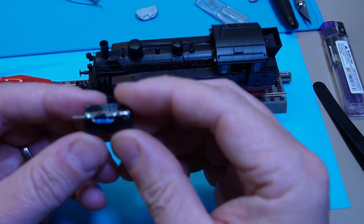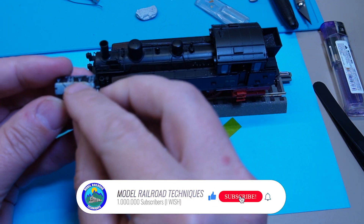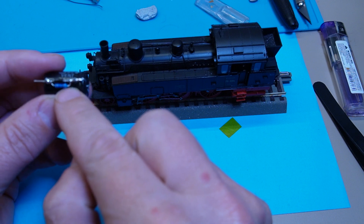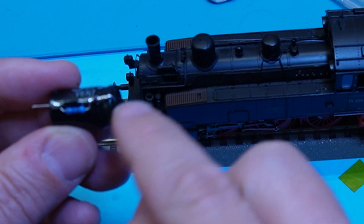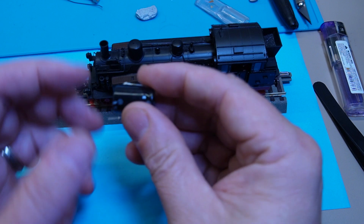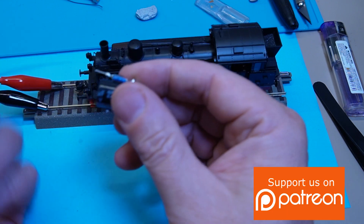So we'll start with the little assembled circuit here. We've got the cathode side, which is the negative, and all the other components go on the anode side. You can see the non-banded end connects to the anode of the capacitor, and then the cathode end goes out to the positive of the DCC decoder. We'll quickly talk about each of these components and what they do individually.